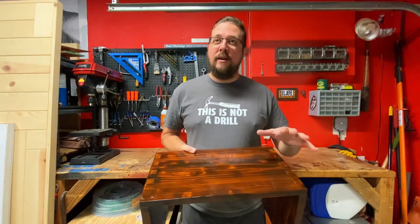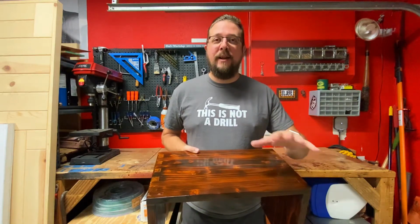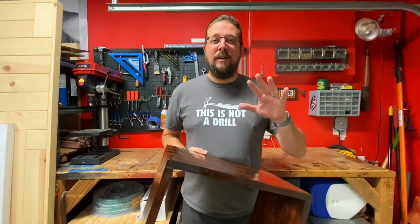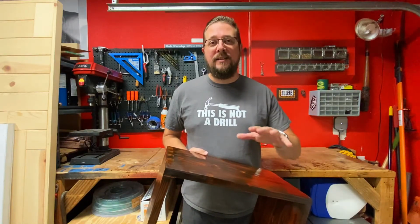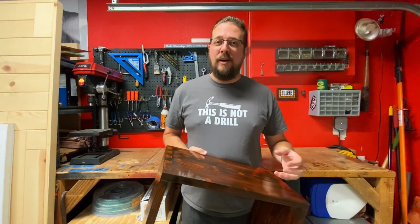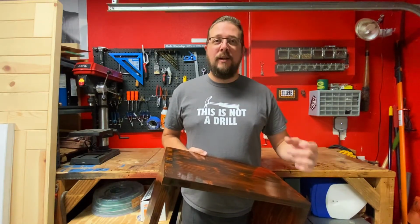It's been pretty hot out here. I finished up, it was like 105 that day. I think it was actually more close to 110. And I just decided, you know what, I'm gonna stop there. I left the pieces sitting on the workbench overnight, and when I did, a lot of the wood shrunk up. Some of it also bowed and cupped.